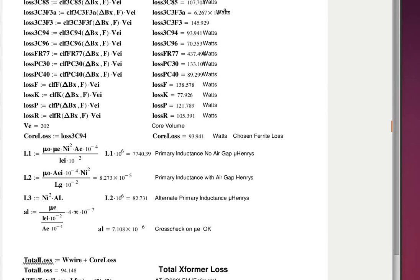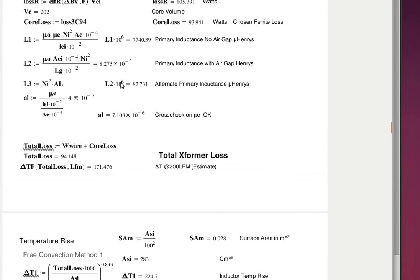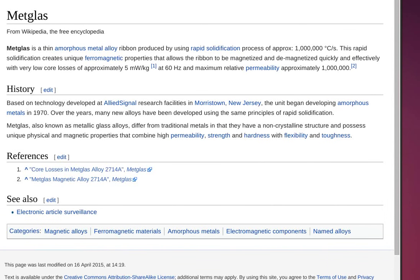When it comes to other losses, where else are the losses coming from in the system? So this is the transformer for the power factor corrector. The main losses are in the FET and the transformer. On the phase modulator, there's a similar core. The losses for the power factor corrector are about 100 watts in the FETs and about 100 watts in the transformer, for a total of 200 watts.